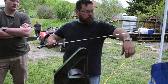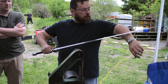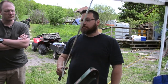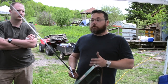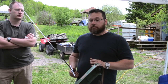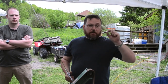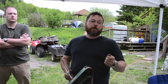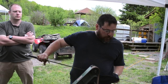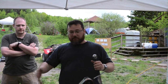Now it should cut well on both sides — and there you go. This is still a 40-degree edge. If I had left it at 400 grit, it would still be sharp, just not this sharp. It wouldn't be shaped any differently — same angles. What's happening is the polish is finer. The edge, instead of looking like a nasty rock face, looks like a smoother, more fine edge that cuts better and bites better at a microscopic level. Same strength. Will it dull faster than a 400-grit edge? Sure, it'll dull down to the 400-grit level faster.